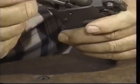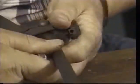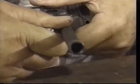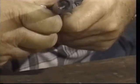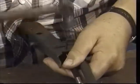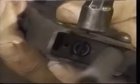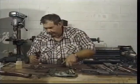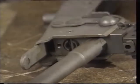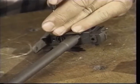It's a little bit tricky to get everything lined up at once. Okay, we got the pin in. We're going to take our pin, start it through our hole to catch the spring. Okay, now what we want to do is finish driving the pin across, and we'll seat it with another punch. Make sure you want it in each side about the same amount.